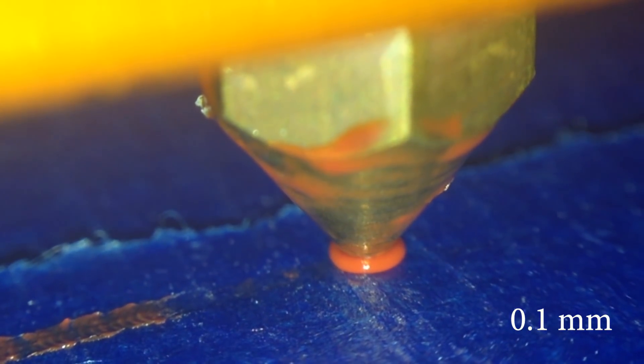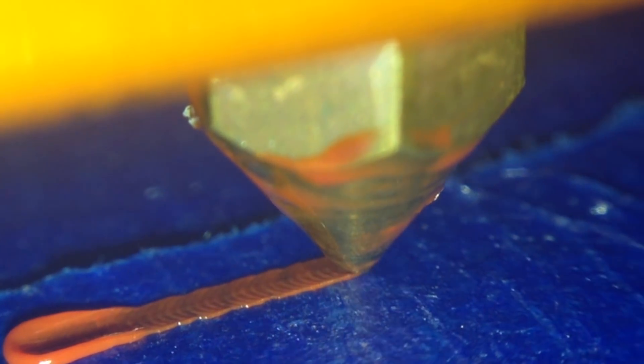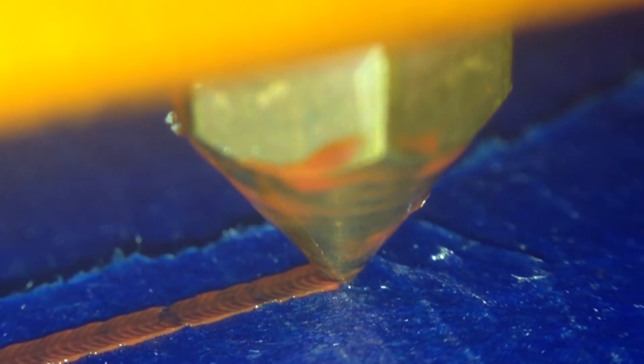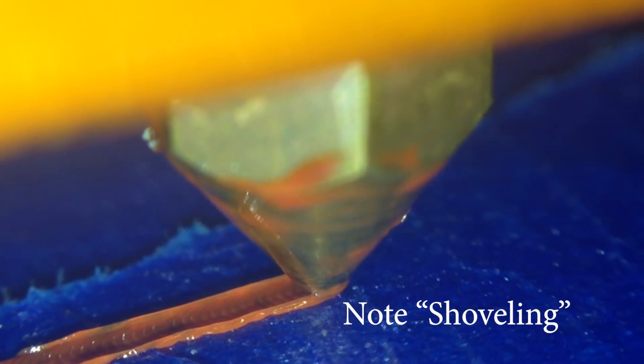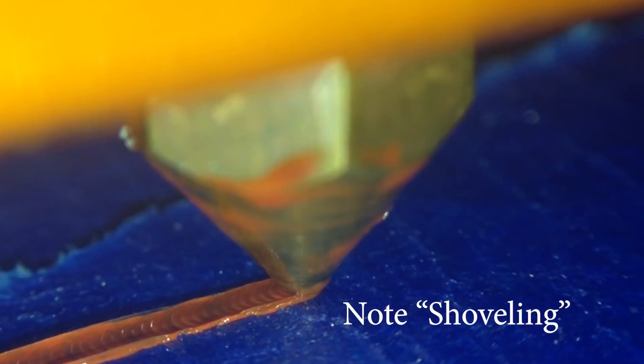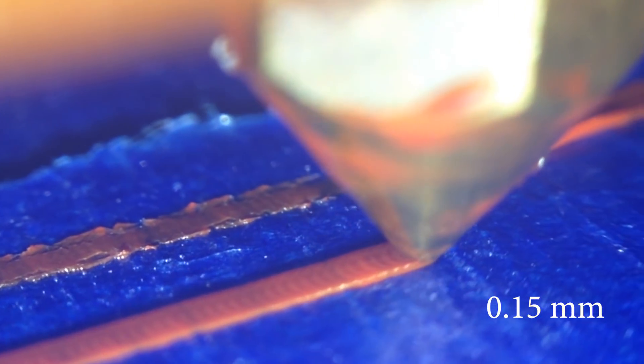Now you're actually seeing the purge that he had set up, and the beginnings of some shoveling. Here you'll see the edges are pretty inconsistent because it's squishing out, and you notice the shoveling that starts happening. That's going to give you an extremely rough surface if you rubbed your finger on it. Here you're seeing what looks like a decent little layer, but it's still too thin, and you're actually going to see almost the bed through the layer.